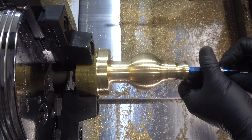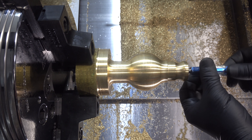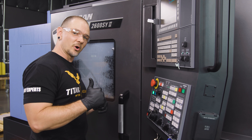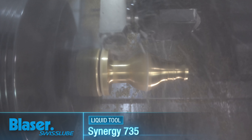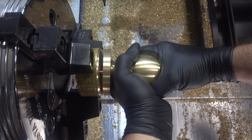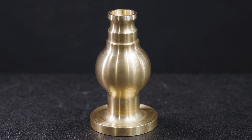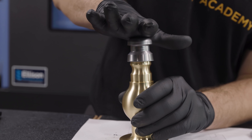No thread is good until we check it with our trusty thread gauge. Now because this is a pretty big part, it's too big — I don't want it falling in my chip conveyor, and it's also too big for my parts catcher — so I'm going to come in with my part-off tool, feed to X.2, and that's going to allow me to just break that part off. There you have it — another brass part. We used our Mastercam dynamic toolpath to turn everything down, machined the front face, the counterbore, and the thread for the Vero S pin. Now we'll go ahead and get it over to the mill department.